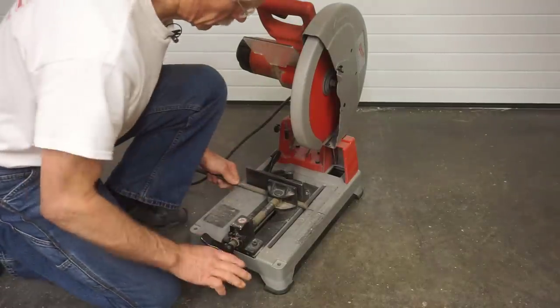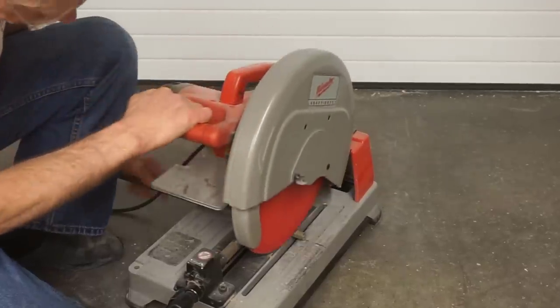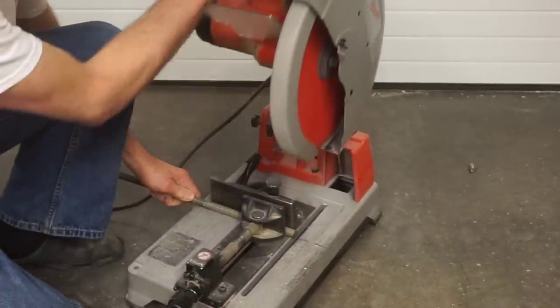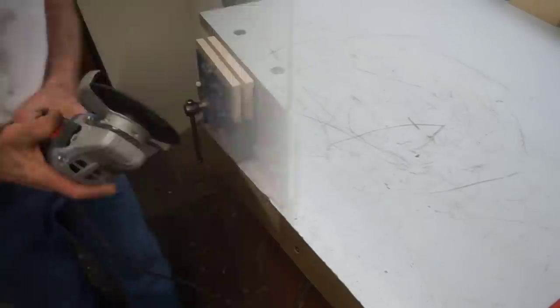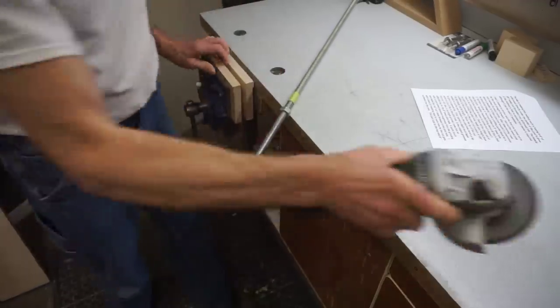Using the pilot hole depth plus the height from the subfloor to the shoulder in the post, I cut a piece of 5/8-inch national coarse thread ready rod to length using a Milwaukee dry-cut saw. Since the tip of the rod needs to cut its own threads in the pilot hole, here's a tip to give it a special tip: I grind a slight blunt taper point on it so it fits into the pilot hole.